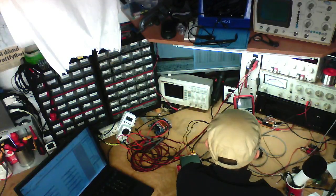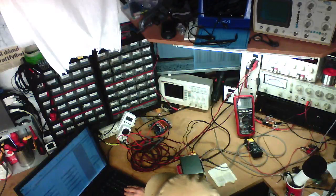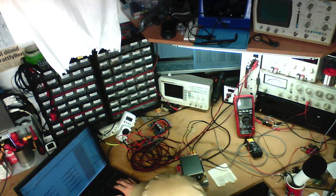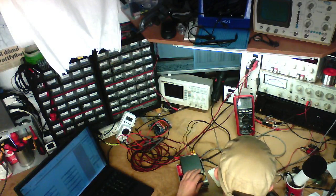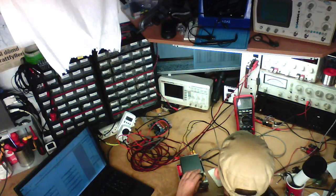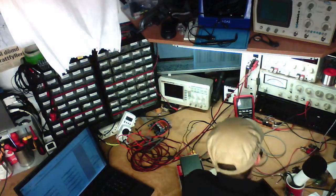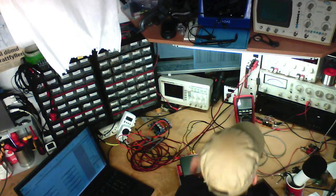And we've got actually less distortion than we had at 8 ohms. Despite putting out a third more power, we've got 0.29 on the left channel at 32 watts into 4 ohms. And the right channel, I think that's the better one, yeah? So we've got 11.31 volts. There we go. Yep, considerably less distortion on the right channel. We've got 0.17.